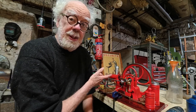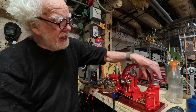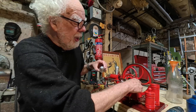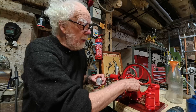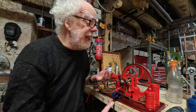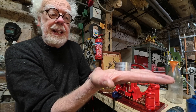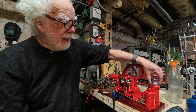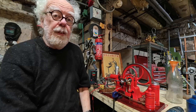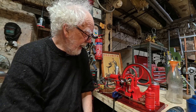The second thing I modified — which is great — is the water tank. The return to the water tank is really near the top, and when it's running water was splashing out all over my desk, losing the water which is vital for jacket cooling. So I made a simple aluminium turning cap for the top of the water tank — much better, keeps the water level.